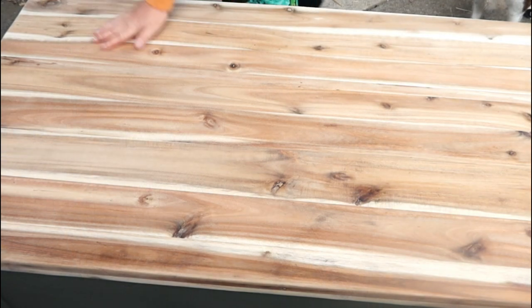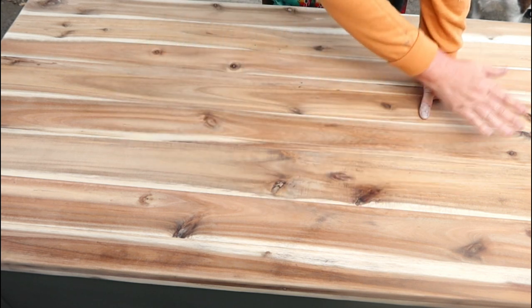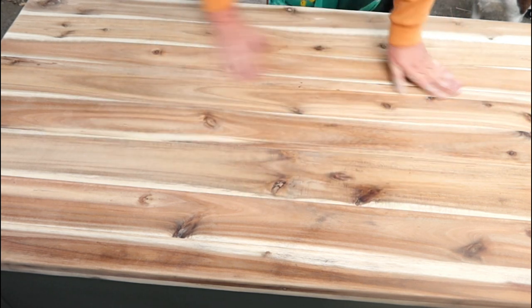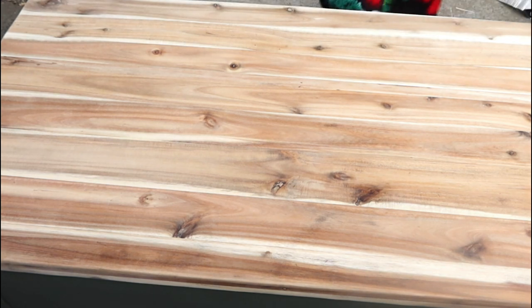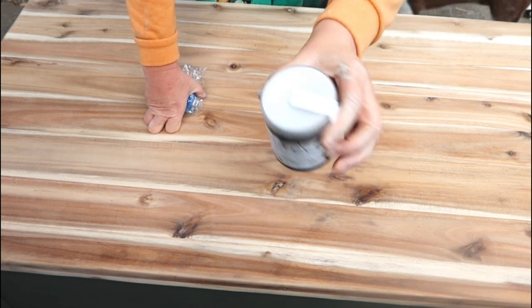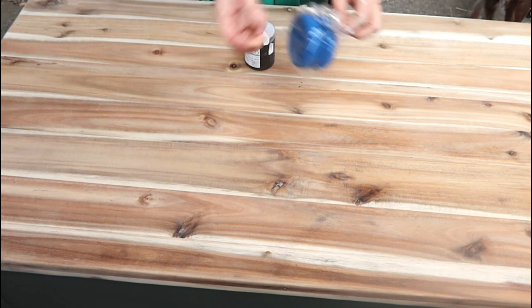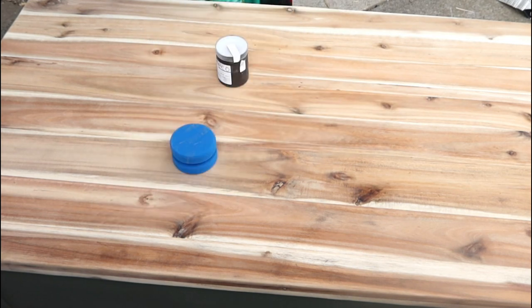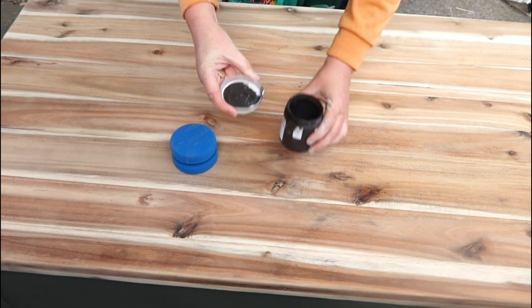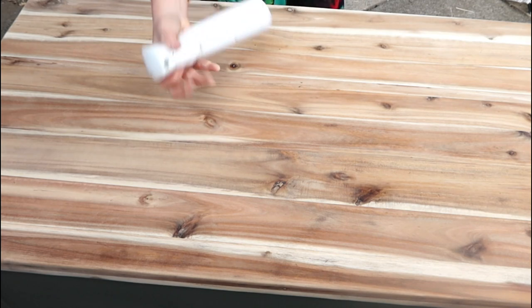Let's get some stain on. It had a rough sand with the 120, and all I've done then is go over it by hand with a 240 grit just to smooth it right out and get it ready for staining. I'm using Pureco Sepia and I want a really light coat of it because I don't want to hide any of this — it's just beautiful. I'm going to apply it with the Dixie Belle Gator Hide sponge and I'm going to water this and the sponge too because I really want it to be light. It looks really dark in the pot but it really isn't — I've used this on a few projects and I just love it. I've got my spritzer bottle ready.